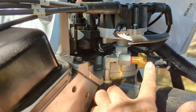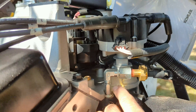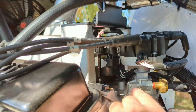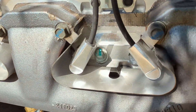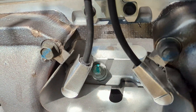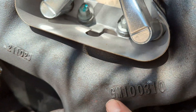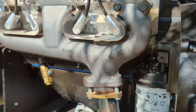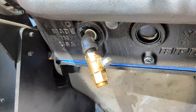This must be maybe an oil temp or pressure sensor — probably not coolant because they'd mount that closer to what they're measuring. There's a distributor — I assume it's electronic ignition with the coil back in there. The spark plugs are interesting to me; maybe they're common for GM engines, but they've got metal caps over the spark plug boots and heat shields. Another GM casting number, which further reinforces that this is probably a General Motors engine of some kind. There's the coolant drain valve on the opposite side — I showed you the one on the other side.